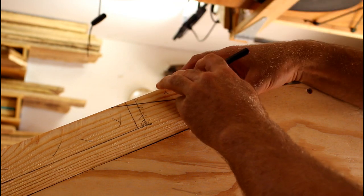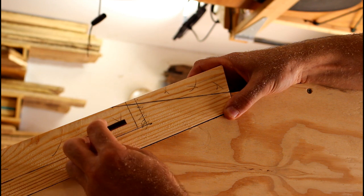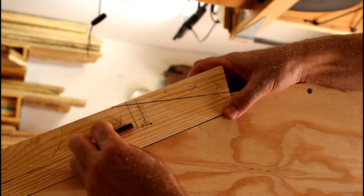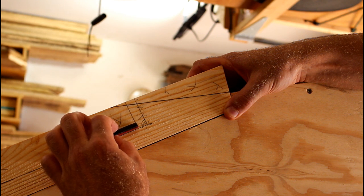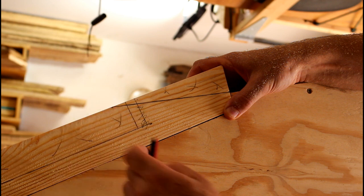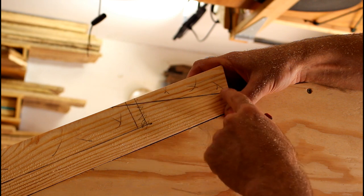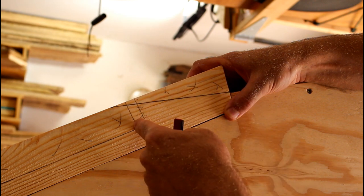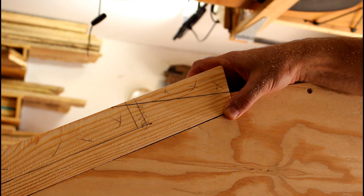That's the width of the door that I'm going to build, but I'm going to be having this gasket on here which will compress to help keep water out. And so I calculated this is 1/4 inch I need, so I found where I had 1.5 inches here, and so I'm going to cut this out on my bandsaw. I'm going to run this on my table saw until I can, and then finish the cut on the bandsaw.